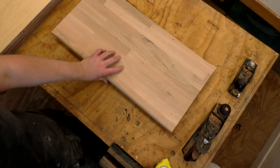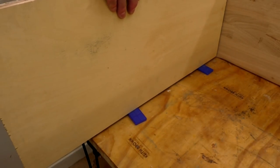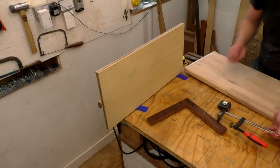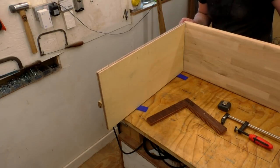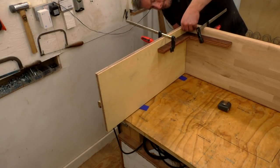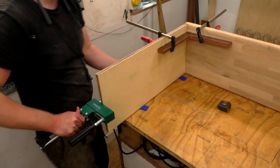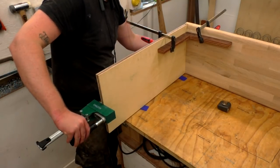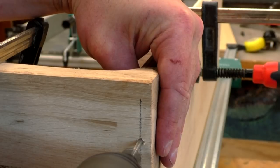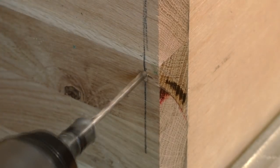To assemble the shelving part of the desks I laid out the pieces on my workbench and used some 5mm spacers to position the plywood side panels where I wanted them, because later I'll be adding a 5mm trim piece to cover the end grain of the plywood side panels. I added glue and then clamped on some plywood clamping squares to keep the two panels at 90 degrees — I got the idea for these from a Peter Millard video which I'll link to in the description box below. They're really handy and really easy to make too. As the bottom panel will later have casters added I offered up one so I could figure out where I wanted to drill the holes, then drilled the pilot holes with a countersinking bit and added screws. I was happy to use screws here because they won't be visible down on the bottom.